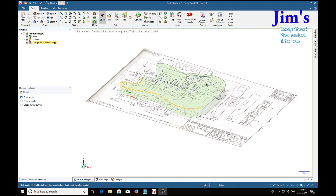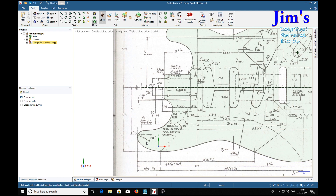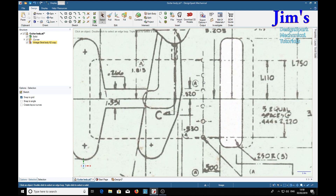Now we're going to start putting a few extra holes in here using techniques you might not have seen before, and we'll swivel this round. There are six holes here to put in: a hole at the bottom for our strap, a hole at a strange angle on a curve for the strap, and four holes to fix the neck. These are countersunk with a rather odd angle of 82 degrees, and the countersinks are on the far side. So let's get started with these six holes.